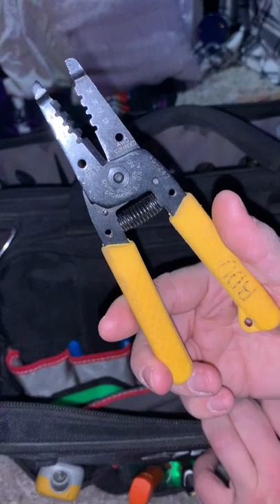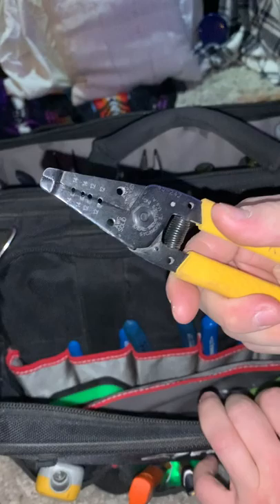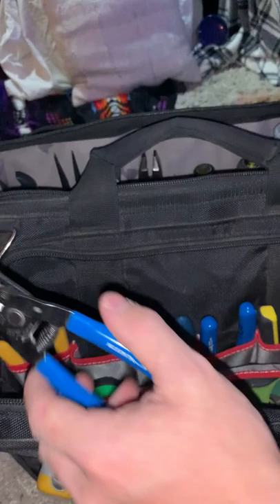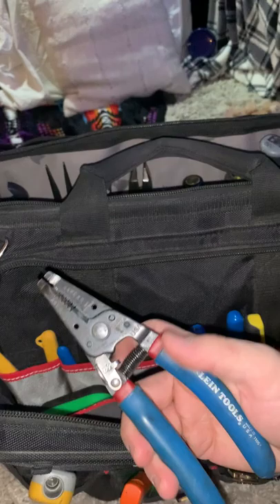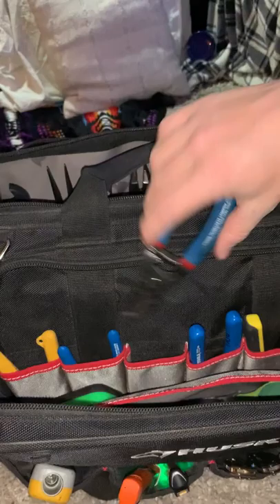Over here on the left side I've got my most-used strippers — these are my Ideal strippers. They strip 2-12 wires and 2-14, so making up switches and receptacles goes really quick. I can strip two or four wires at a time if it's 14. These do 10 to 12 solid and stranded and 20 to 22, so nice to have a small pair. I used to have the large pair but it was stolen from my last bag and I haven't bought another yet. I still have my low-volt pair that does 20 to 22 and 30 to 32.